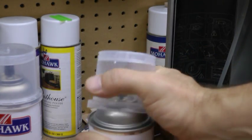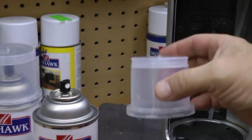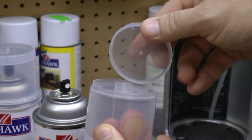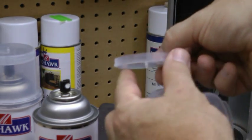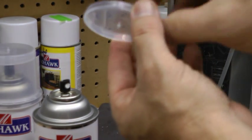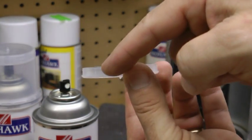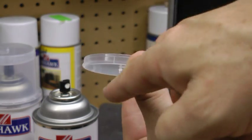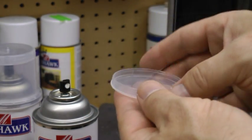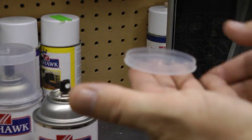The cap is where all the magic happens. The small top disc attaches to the machine plunger and pushes the fluid stored in the cap reservoir into the aerosol can. The flange of the disc is up, and the nipple is pointed down when the disc is put in place on the machine plunger.